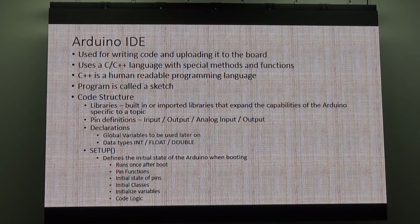When we get to the global variables that we define, int, an integer, a float, a double, they're all, when Keith was talking about words, what were the other data types that you were talking about? Yeah, you have a byte, a word which is 16-bit. Yeah, so a double word is 32. Yeah, and that's what we're talking about here with ints, floats, doubles. It's getting those binary words and we're just making them into something that's easy to read.